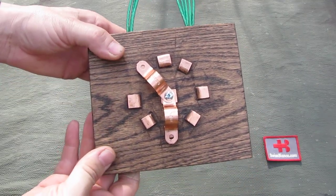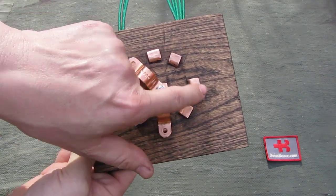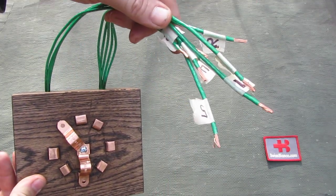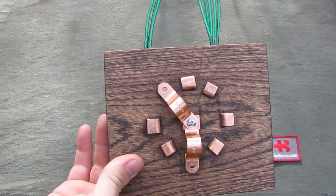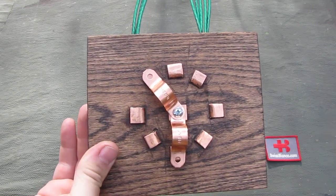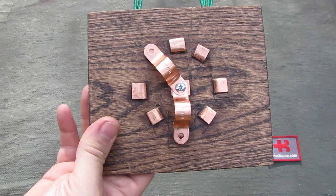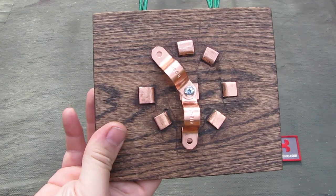And then we have more switches, 5 switches, number 1, 2, 3, 4, 5 for different radios. They come out on the other side, through the other hole, with the 5 cables also marked, so that you can switch from up to 3 antennas to up to 5 different radios, and that is quite likely as much as I am ever going to use in my personal setup. Of course you can alter that to make the switch for as many as you want to use.